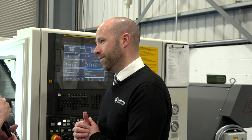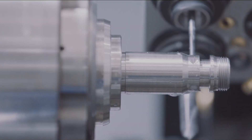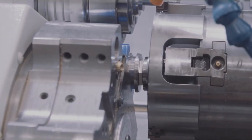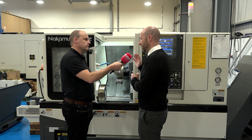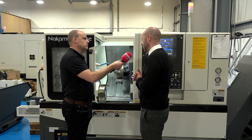What are you achieving by doing that though — a reduction in part production time? Yeah, it's cycle time. More cuts at once. Yes, so if you're looking at a true twin-spindle with a single turret, we can only be working on one spindle at a time. If you've got five minutes on the left spindle and five minutes on the right spindle, you've got a ten minute cycle time. When we come over to the sub-spindle, the more operations it can do at the same time, we are just eating into and removing that cycle time.